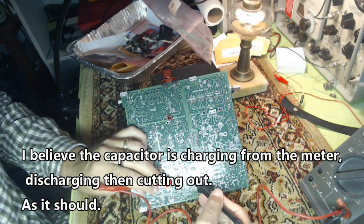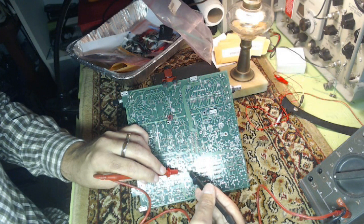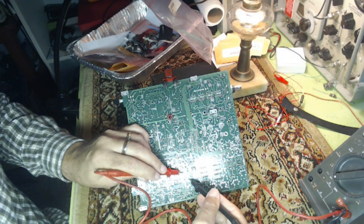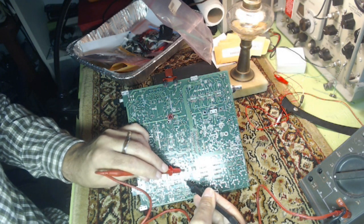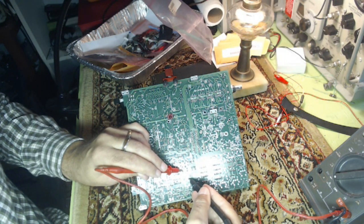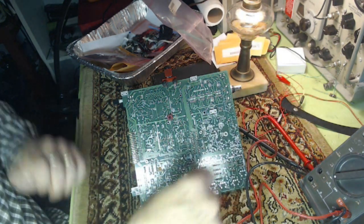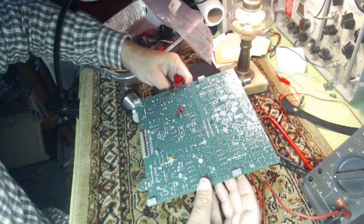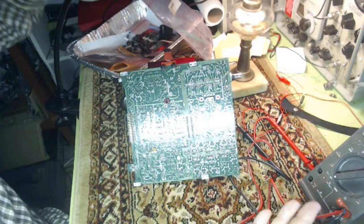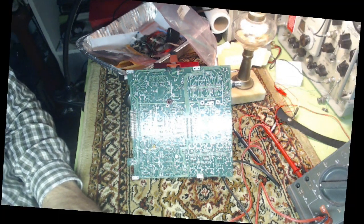The most important thing is from side to side, from pin 1 to pin 2, I have continuity. From pin 3 to pin 4, I have continuity. And then across them, I just get that one little beep. That's what was throwing me off. Why is this thing just beeping once and stopping? I think it's because there's a capacitor to ground on the one side of it. So you get that kind of little charge and release situation going on there. Even though there's no electricity through this yet, there is a little bit of a current going through there from the multimeter. I believe. I think I'm right. Hopefully. Thanks for watching.